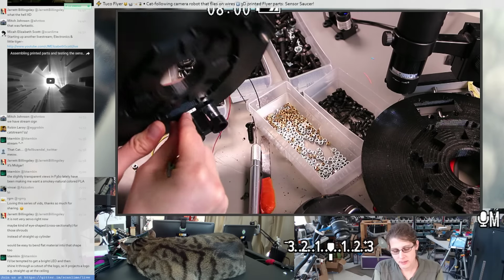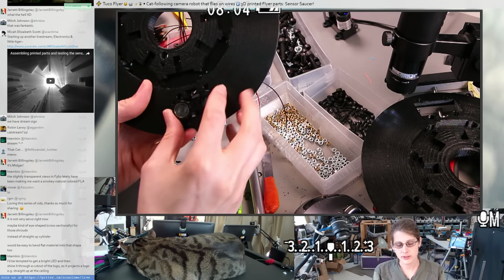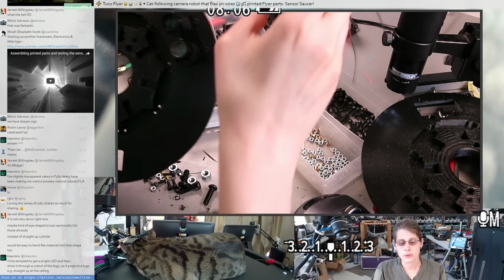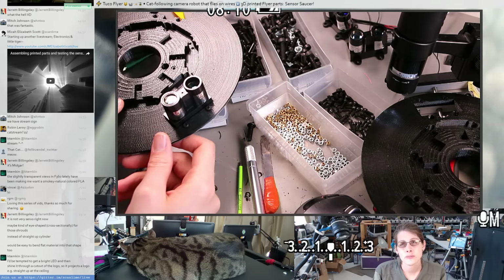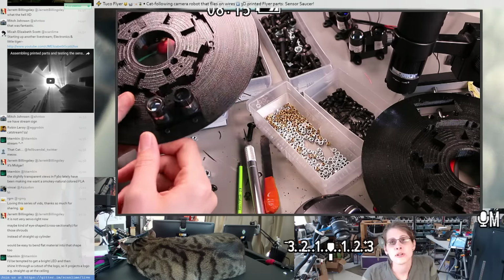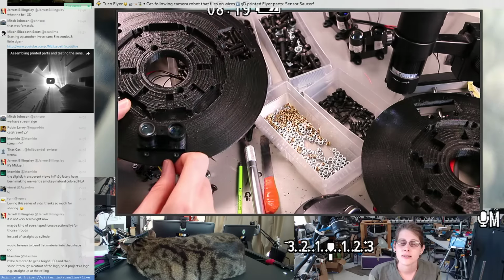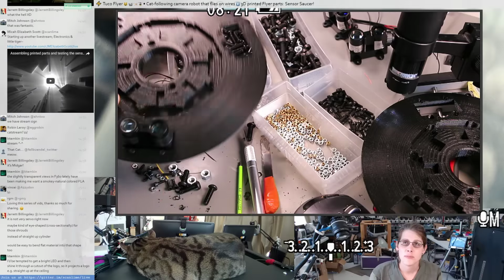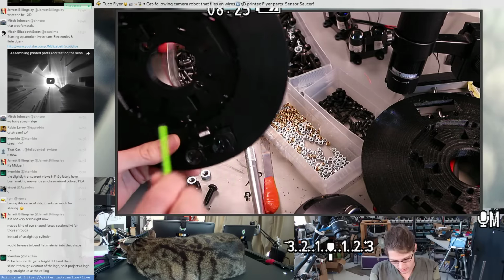I don't know exactly how many LEDs I'm putting on this yet. I'm probably going to use some fairly dense ones, like the 144 per meter, which I was measuring actually to do the CAD models, and I think they might actually be specified. As I was measuring, they ended up being exactly some round number to the tenth of a millimeter. I think it was like 6.9 millimeters between LEDs or something like that.